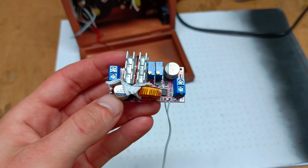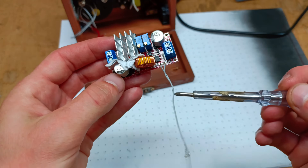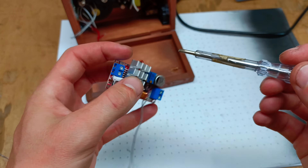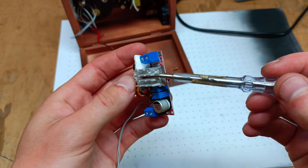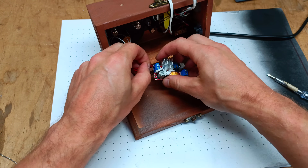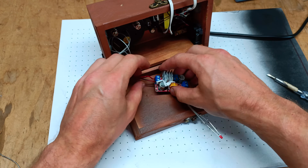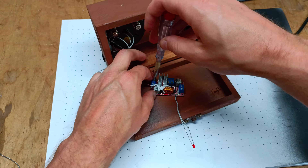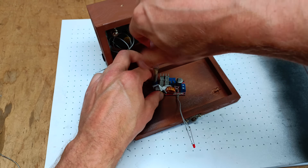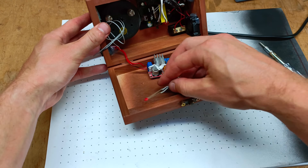The next very important component is the DC step-down converter. It's the same converter used in a previous video about the Motorola cell phone. It has the capability to set a constant voltage and constant charging current, making it ideal for charging lithium-ion cells. I've already soldered a red LED to inform us that the charging process is running, and also mounted an additional radiator to make sure the converter won't overheat during charging. Additionally, it has a wide input voltage range which makes the Powerbox even more versatile. I connect the step-down converter to the DC charging port of the power box.